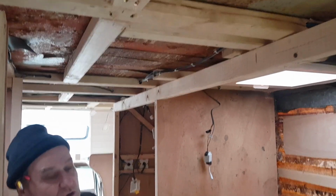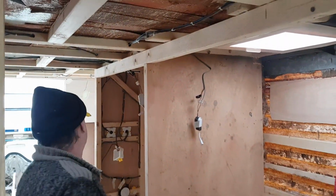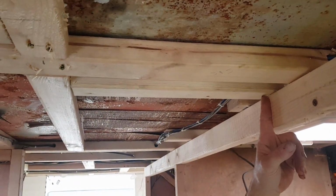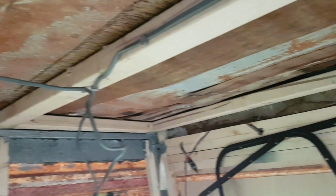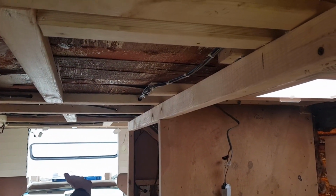The cladding is only 2.4 metres long, so we can only take it 2.4 metres. We've got a flat part of the roof from here, which we've taken back 2.4 metres. If you span all the way back, John, and keep walking down, I'll explain the reason why we're doing it down there. We now put in a strut up here, so the 2.4 metres finishes there. Now obviously we continue on to the back with the join going across there, as we do at the front as well. But the beauty of the way we've done it is going from the back, it's not 2.4 metres, which we can obviously cut pieces down. The longest piece is going to be in the centre, 2.4 metres. Then a slight slope going up, and then it's less than 2.4 metres to the end.